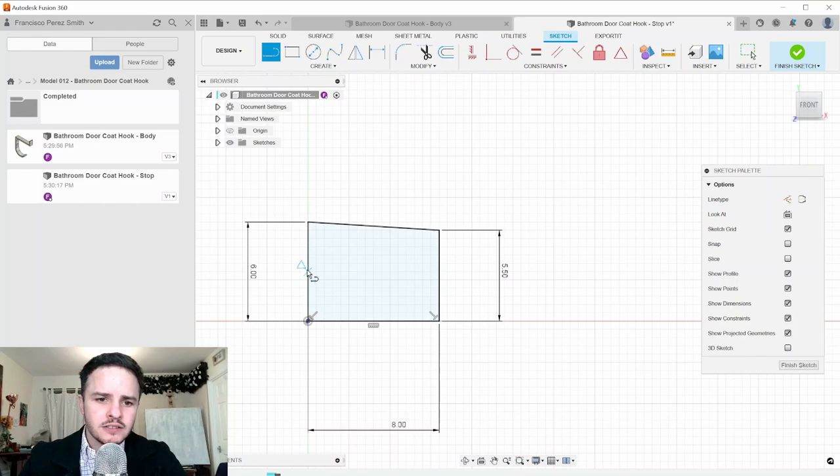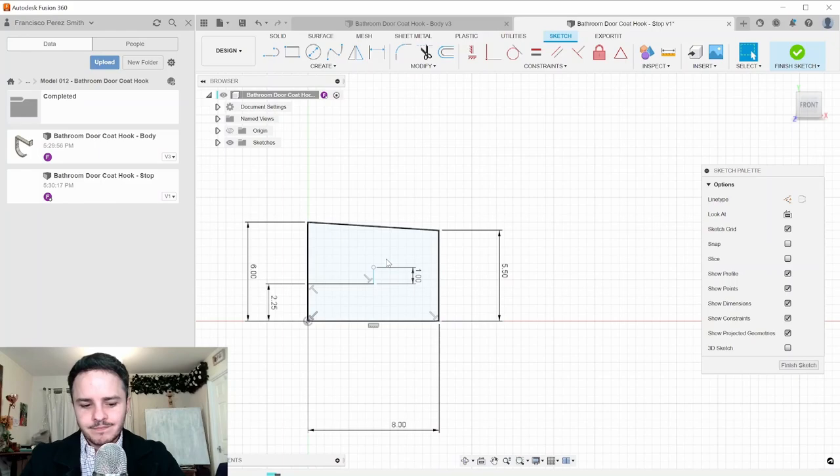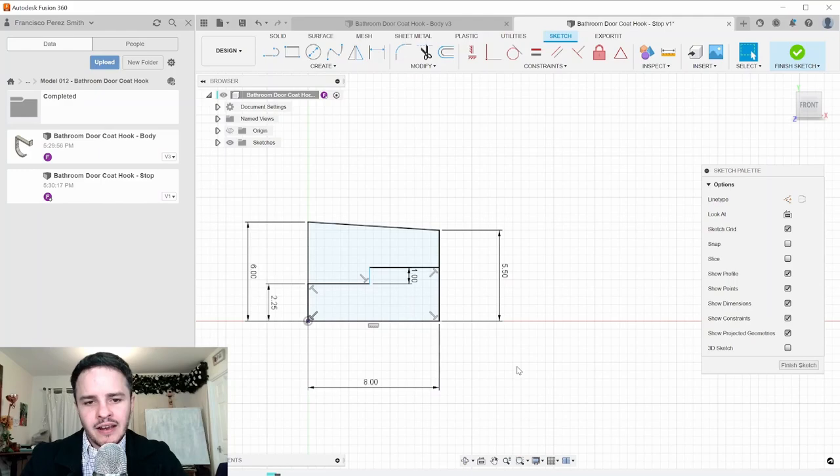Add a line for the internal cavity and set the radius to 4.5/2. Mouse over the midline so the shoulder sits about halfway along — roughly 1 millimeter deep — then bring it back to the mouth. The profile shows blue because it's not fully constrained, so add a dimension: set the shoulder position to 4 millimeters from the end. That constrains it fully.